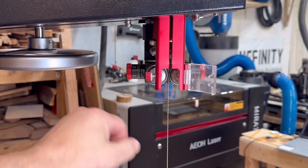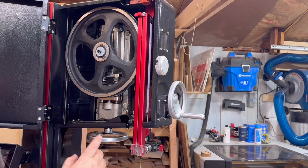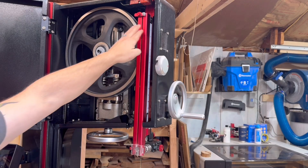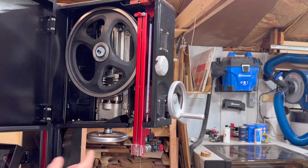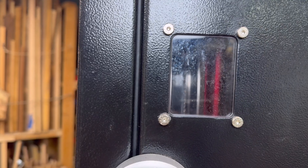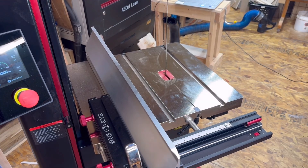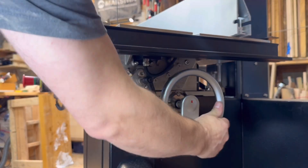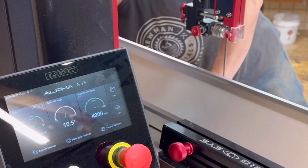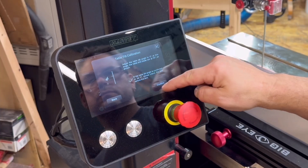Those bearings are one and a quarter inches, so they're larger for more durability. If you open the top, you can hear beeping — there's a sensor that tells you if either door is open and it won't operate if it is. These are solid cast iron wheels with the blade guard going all the way up through the top. A built-in window allows you to see the position of the blade on the wheel. The big eye fence glides beautifully on the nickel-plated top. They redesigned the whole trunnion system, so not only does it integrate with the screen to show your angle, you also get really smooth operation. Calibrating the table to 90 degrees is really easy.